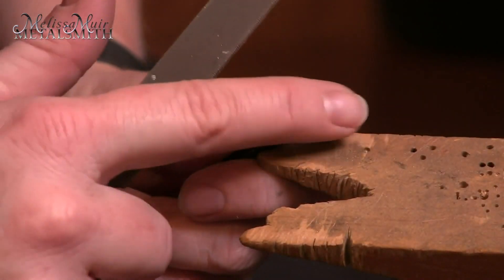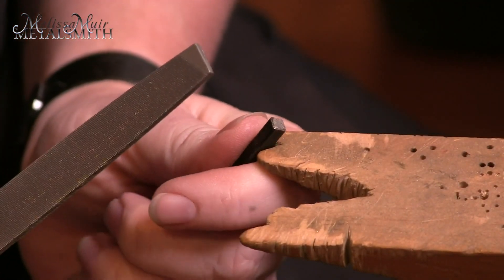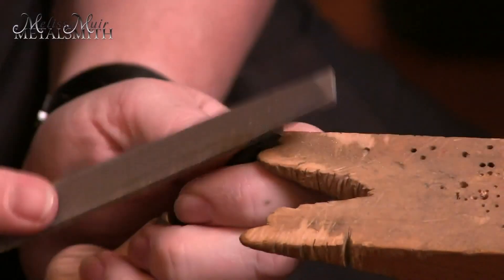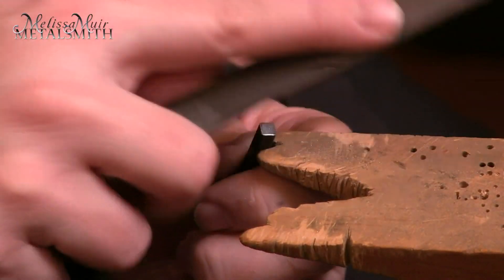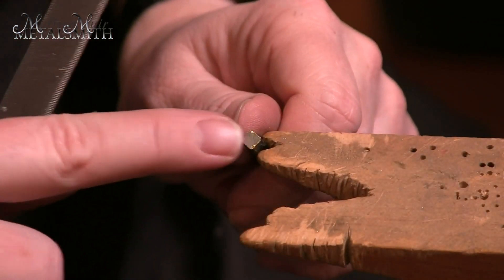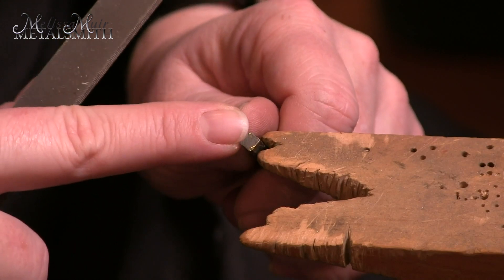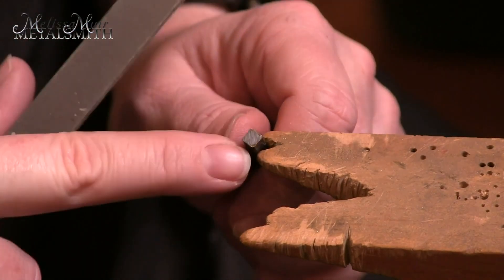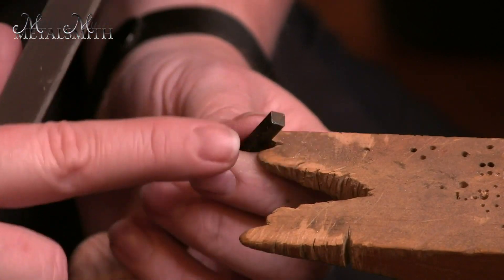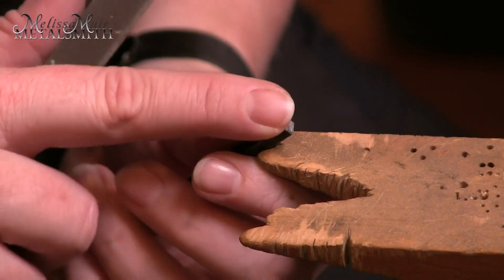I'm going to start to bring in these corners as well. As I go, I'm just kind of rotating this around. You can tell when you've removed a burr because things are going to flow a lot easier. You want to make certain that you remove all of your marks from that surface, because whatever you have on the surface is going to embed itself into your bezel when you go to set that stone. Use your fingers to feel this — your fingers will tell you if there's any rough spots or anything sharp that still needs to be removed.